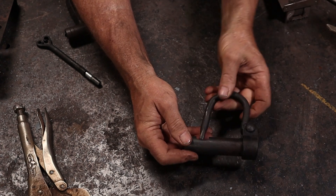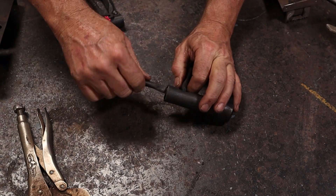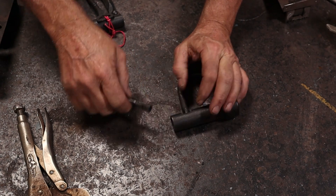I have persisted, and yes, this lock works. It moves much more smoothly than it did. I did make sure to run the tap through there one last time to clean it up in case I deformed that a little bit through all that other messing around. But that goes down there just fine. And once you get that lined up, it's just a matter of threading it in as far as you feel like you need to. This is a relatively secure lock — you can't open it unless you take that bolt back out. Yes, you could stick a pair of needle nose pliers in there and probably open it that way, and somebody said you could probably get a nut driver on there. If you wanted to, you could substitute this bolt for a socket cap screw and just use an Allen wrench, and you'd save all that trouble making the key. But I think learning to make keys is going to be one of the key components of learning to make locks, so I need to get way better at making keys.